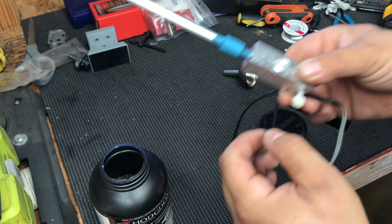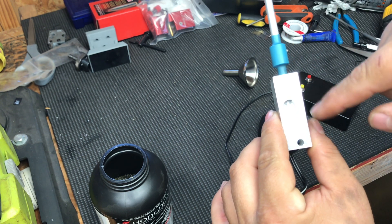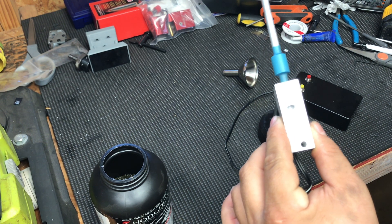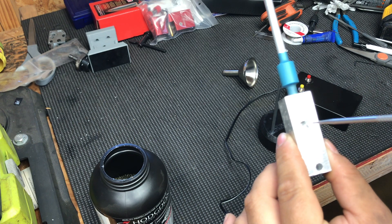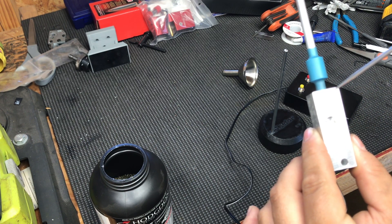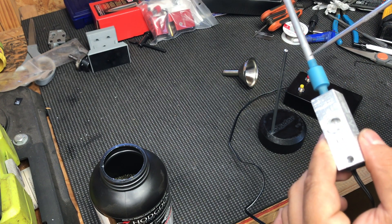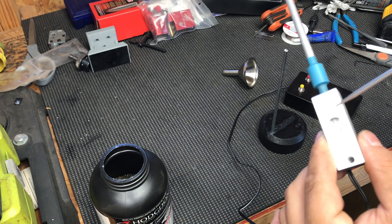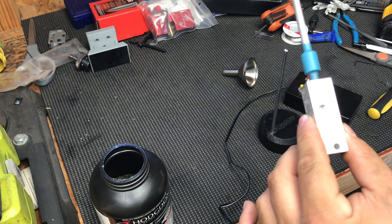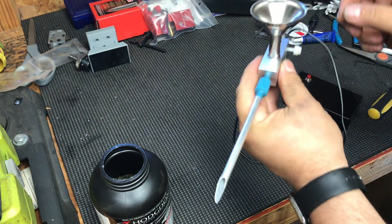There are still a few kernels of powder in there. I stuck the tube all the way to the inside so the vibration makes the kernels actually go into the tube. The tube stopping short right about here wasn't cutting it — the kernels were getting stuck at the lip of this tube. So I made the tube come all the way back and it started working perfectly well.